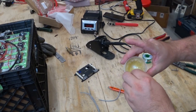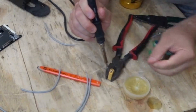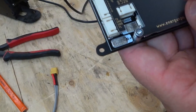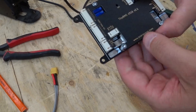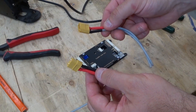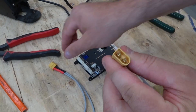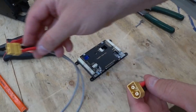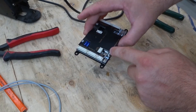First thing I'm doing is just getting some flux on all my wires. Here's the tiny BMS, and over here in the corner is a B minus and a B positive. Those need to attach directly to the battery bank to receive power to the unit. So I made these two little connectors — these are XT60s, little hobby connectors. I think this side will go on the BMS, and this one over here is a little bit more protected and goes on the battery. So I'll just strip these ends and put some solder on these.